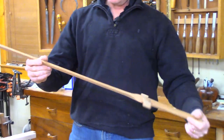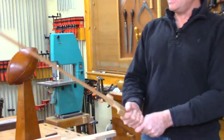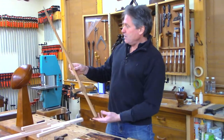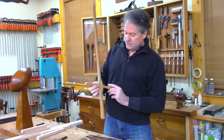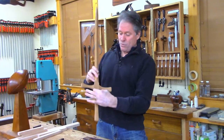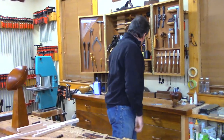Look at that fine blade. It's incredible. So sharp, too. Watch out. But it's really fun to make, and I'll mention the dimensions if you want to do one. I just kind of figured it out with this. It's about 39 and a quarter inches long. Right across here is 9 1/8, I think. And the stock is 7/8 thick by 1 3/4 inches wide. And this handle, I should have measured that before.